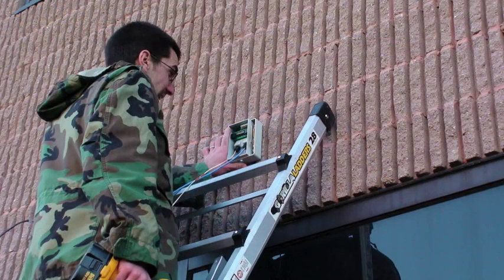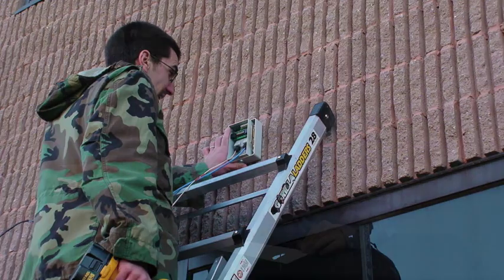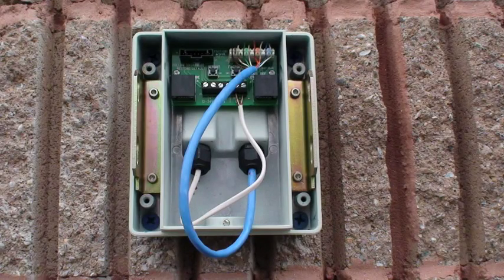Since we are wall mounting the Sentinel on rough masonry, we will not use the drill template — the drill template is better suited for smooth surfaces. Instead, we'll use the back box to locate the four mounting holes. Data cabling must be routed to the right side of the back box labeled 'wall side Ethernet,' and I/O cabling used for the relay output must be routed toward the middle of the back box and terminated on the screw terminal block. After the cables are terminated, make sure to tighten the compression fittings to ensure water cannot enter the back box from the cable entry.